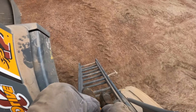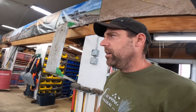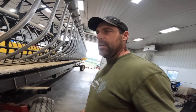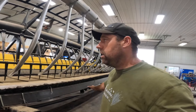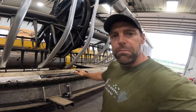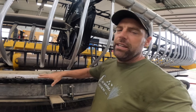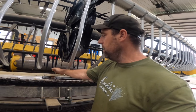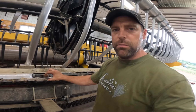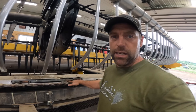I think what I'm going to do the rest of the day is work on this combine head — this draper head — and probably end the video with that. I'll update you guys when I get it all done. I do want to show you: there's going to be a major update kit that cost almost $3,000 that's going to go in the middle to update this center drive, which I've had a lot of issues with. I've had two of these heads — a 30-foot and now this 40-foot. For some reason on this 40-foot I am breaking these little stubs, causing a lot of damage to the cast piece which is very expensive. So we updated it, and I'll let you know what I think once it's installed. Thanks for watching — I'll see you guys next time with some more updates when we're harvesting some wheat, hopefully.